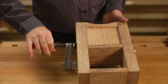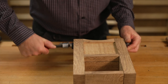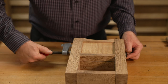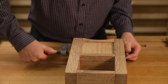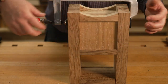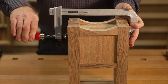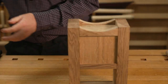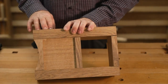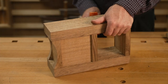A little bit on the front, so let's just see if that panel squeezes in, or do we need a tiny bit more. We'll squeeze up. Bit firm. Alright, so I've a little bit of a gap just here, so it's suggesting that panel's just a fraction wide. So we've got to take it apart to do another task as well now, but when we take it apart, I know I can take a tiny bit just off the sides again. Exactly the same as we've done, we can adjust that panel. So let's take it apart.